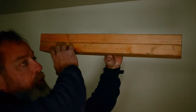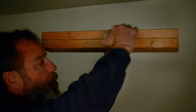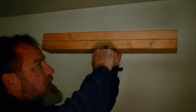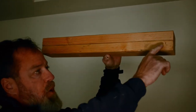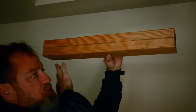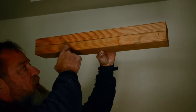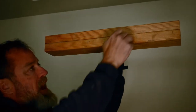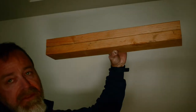So most interior door frames, the rough opening where the door drops inside, the top overhead that you walk underneath, looks just like this. Two 2x4s stacked on top of each other. It does very little structurally, okay? All it is is a place to be able to nail your trim and hold the two sides apart at an even distance. So what you're doing is cutting out this bottom section, just a pocket, and pulling that out. So this remains intact, and this part here is gone, say 10 inches in the case of what we just did, to allow for a gun or a key or a wallet to go in there.